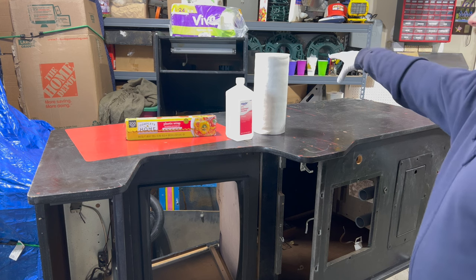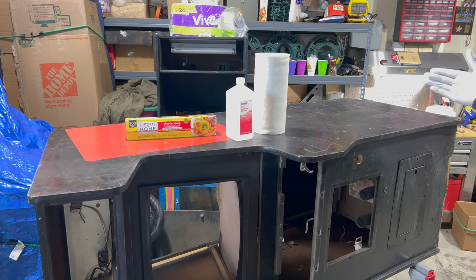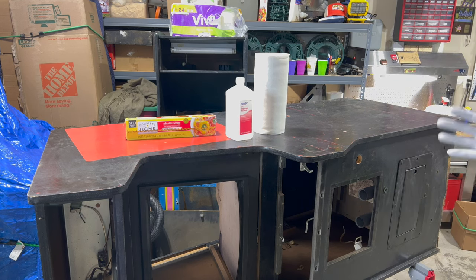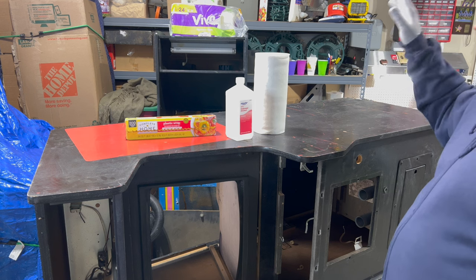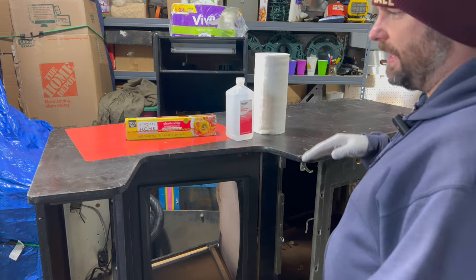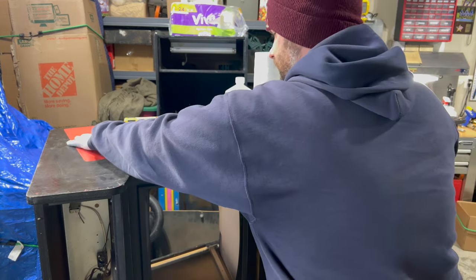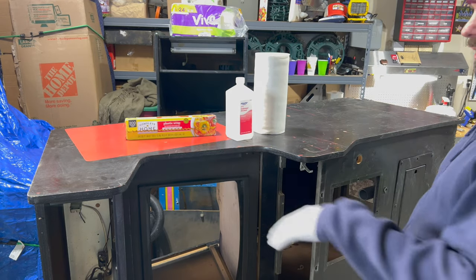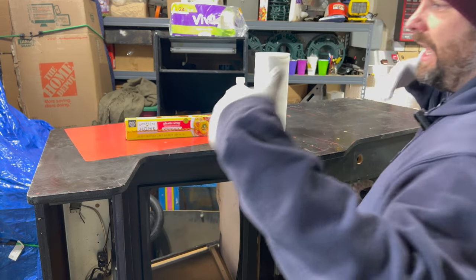Looking at the cabinet itself, I think it was originally painted over with this brownish-orangish-red paint, and then the SNK Street Smart side art decal was applied to that. Then they painted around that decal to make the rest of the cabinet black — kind of masked it off or carefully painted around the side art. So we've got two layers of paint to take off and we want to be very gentle to recover and restore the original stenciled artwork. If we didn't care about saving that artwork underneath, we could use a more heavy-duty stripper like Citrus Strip and take it straight down to the wood.